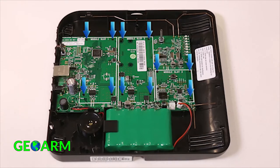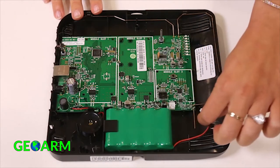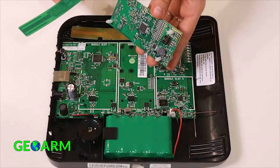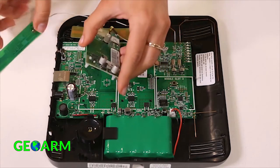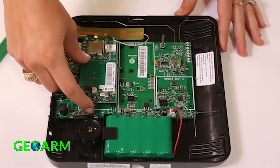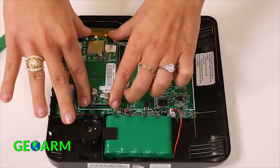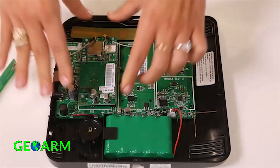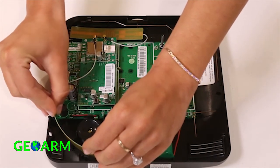There are also three or four holes on each card allowing for mounting pegs to be attached. Be sure to remove the backup battery prior to installing any expansion cards. The most common expansion card is a cellular communication device. This should be installed in slot 1, allowing for proper installation of the internal antenna. Be sure to align the four pre-installed mounting pegs into the holes on each corner and the communication pins with the mainboard connector as shown. Press firmly and evenly over each of the corner posts until it snaps securely into place. Put the antenna into the holding slot located near the sounder of the Connect Plus system.